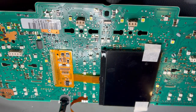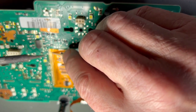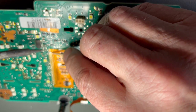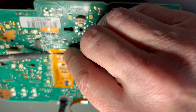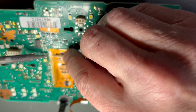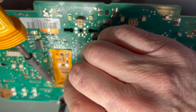Now we take a toothpick and use it to actually hold the ribbon in place as we solder. The toothpick is great for this — it's non-conductive, non-scratching, soft, cheap, and disposable. Starting from the second pin down, press very slightly with the toothpick, then put the iron on top and heat it. You can see the solder flowing along that pad — always move the iron along the direction of the pad, not across. Work your way down every single pin, gently heating it. You can see beautiful shiny joints, and with plenty of solder already on the pads there's no need to add more — less solder means less chance of a short circuit. Work all the way down the connector and then re-solder the final pin at the end.